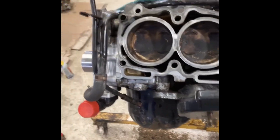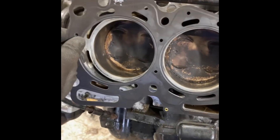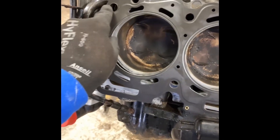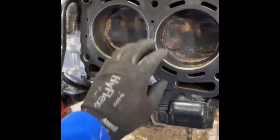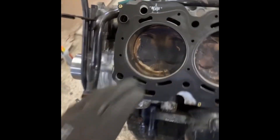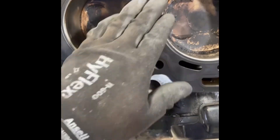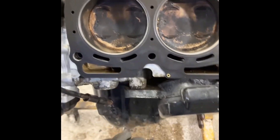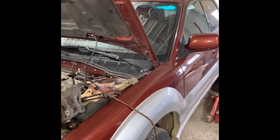Surfaces are clean. I've got these Six Stars gaskets — I don't really use these anymore, I use the Subaru OEM multi-layer steel, but I had these on hand and need to use them. They have a Viton coating, which the Subaru ones don't have. They say over time these will fail too, but I'm at 200,000 miles. Next time I pull this engine out, something else is going in it — possibly two more cylinders — so this will be just fine.